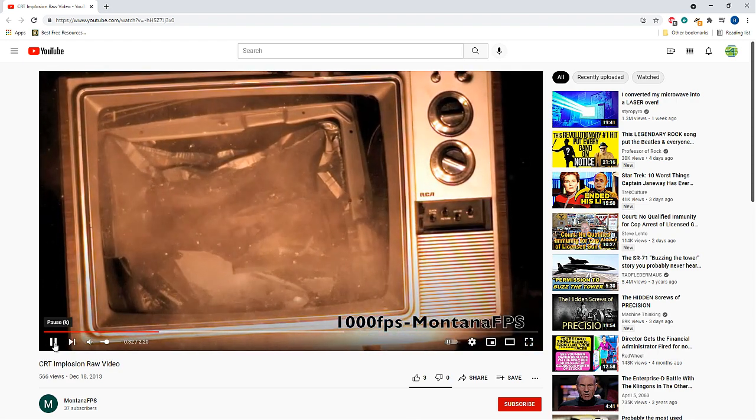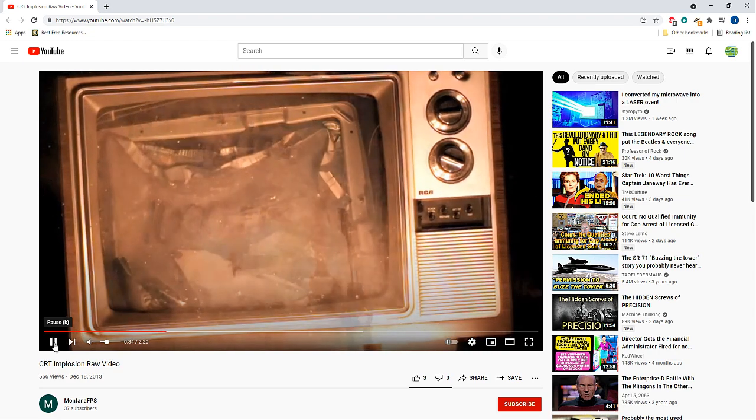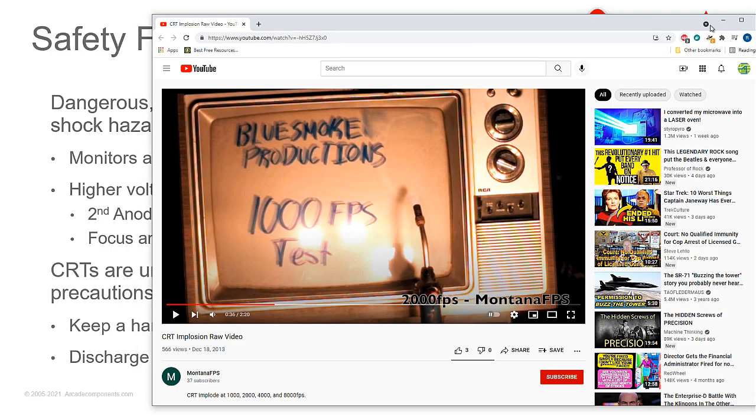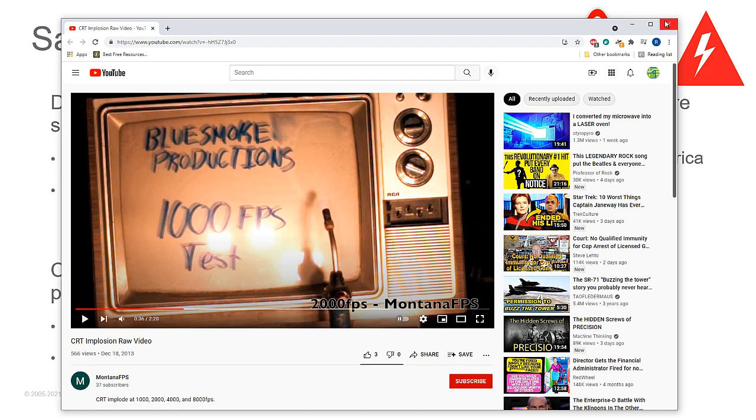And you might have seen monitors where it looks like they have spots and dots and big bunches of gunk around the edges of the tube. And they call that a cataract on monitors. When you see the cataract, that's just the bonding of the safety glass and the glass behind it going bad. So a lot of folks will go to YouTube and they'll see how to remove that safety glass. And it makes it look 100 times better. But you have to be careful, because that glass is more fragile now. You don't have that safety glass there to help protect you.